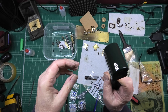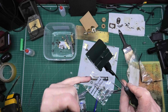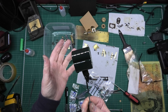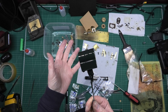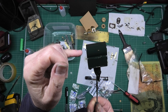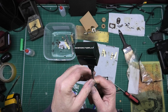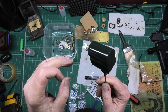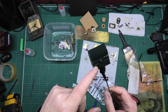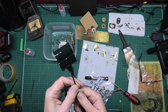This is obviously the piston cylinder and the valve chamber — something like that. I don't know any of the names of these parts; I know where they've come from and where they go because I took it apart. This is actually in three pieces: the piston cylinder, the valve chamber, and also the valve cover. That's had three coats of etching primer and then three coats of Hammerite smooth green, which I think is going to look really nice. This is the exhaust port side — that's the bottom, that's going to be the top. So that's drying.